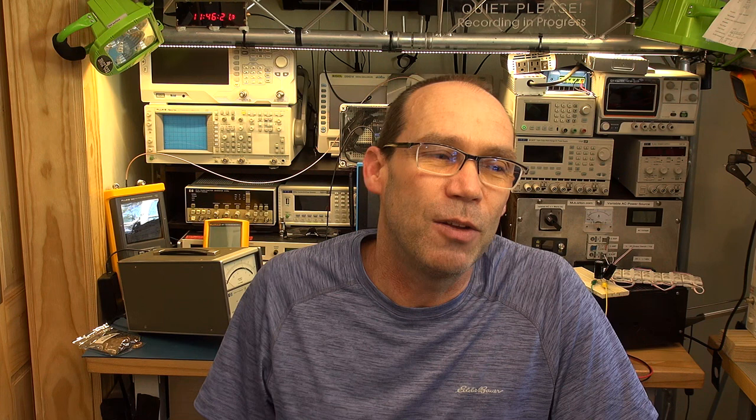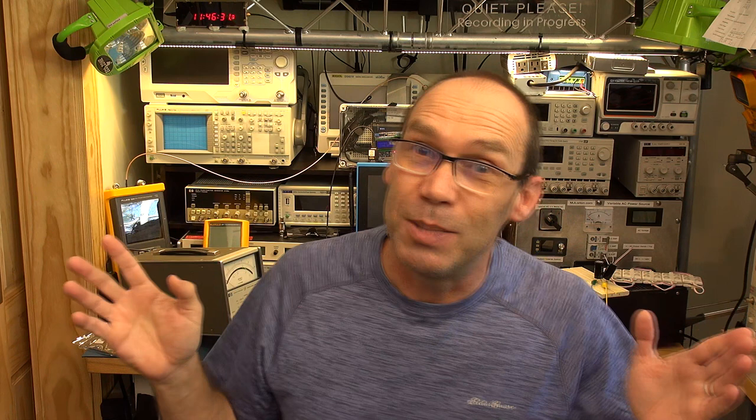So initially I put the 20-watt panel just under the light and switched it on - prior to testing its proper output outside - and I think it was producing between seven and nine watts. I thought okay, that's not too bad. These cheaper panels that claim 20 watts might do 18 watts, and when it heats up probably drop to 15 or 16 watts, so I might achieve that under this light. But I took it outside one day when it was really cool and it was producing over 21 watts - that blew me away. They weren't over-inflating the spec; I might have just got a good sample, but it was producing over its plated spec.